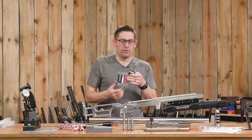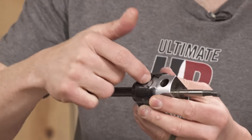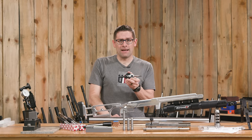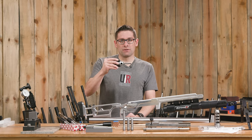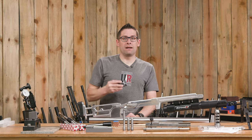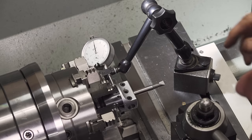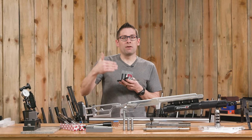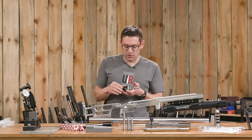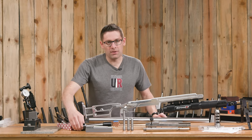So I channeled my inner Bruce Tom and decided to chuck up on the body instead. Look at how stout that is. I just had to align the chuck jaws properly so I could get to the adjustment screw. This made a night and day difference. If you've got a really rigid hold on your boring head and a good quality sharp boring bar, you're going to get really good surface finish. What's really important is not over-cutting your hole. Get your dial indicator on the back side and very carefully zero it out. Loosen the locking clamp screws and very carefully make the adjustment until you see the needle move however much you want to take off in terms of radius — the diameter will be affected by 2x. Simple geometry, and you want to prevent overshooting that final diameter.